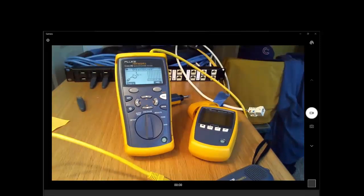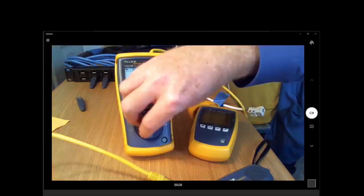And the cable IQ is not requesting power over Ethernet, so the power over Ethernet isn't there. So I think, Jim, you have a point: maybe what they're seeing is that more modern switches tend to do a better job of getting rid of the unbalanced tone that the toner puts on the cable. And so when you're toning a cable that's plugged into a switch, your results are going to be all over the map. Some switches it will work well, other switches it will not work very well.